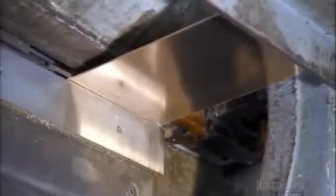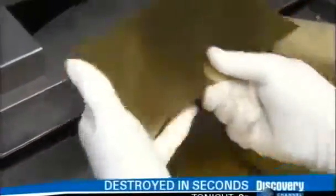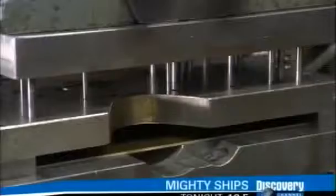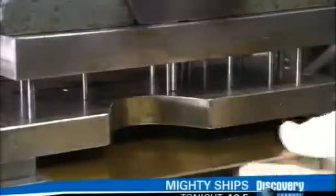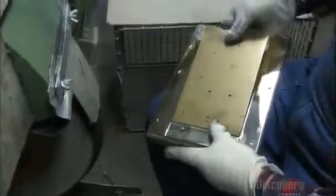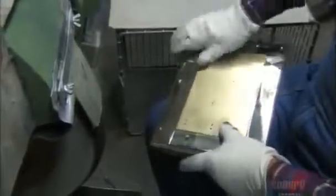The barograph's mechanism rests on a solid brass plate that's 214 mm long by 125 mm wide. A worker greases each one, then places them on a press that punches out holes for the fastening screws. Next, he places the plate in a metal holder and buffs it with a rotating polishing brush.